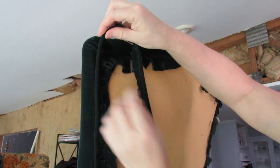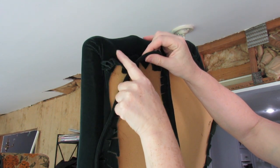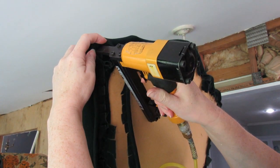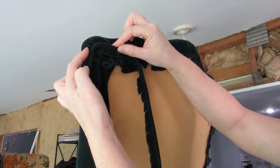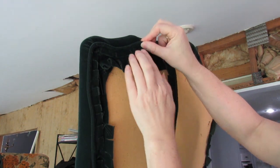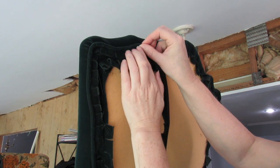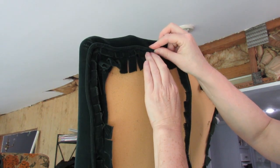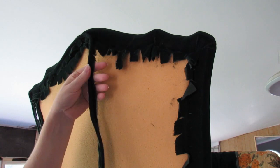Next, up in the corner here — the corner actually goes up and then down. I'm not going to do the up and then down because the aluminium back tacking I'm going to put on won't do that. So I'm going to put the corner in and go across ways. I'm going to bring this down to the lowest point where the wood back is. Put another one here. I'm going to come up to here but not put the sharp twist in because the aluminium won't do that. So I'm going to just bring it up a little way like that, a little bit higher than the bottom of this dip. Here's the bottom of this dip and I'm going to just take it up to the apex here. I've got to cut some more notches in.